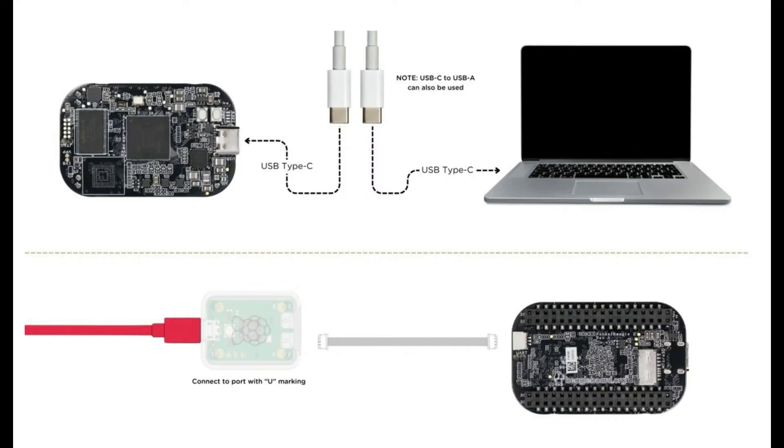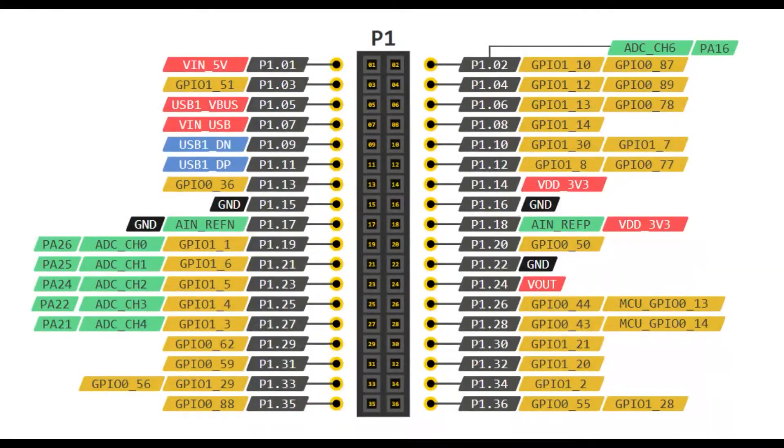There's also a little UART port that you can use with your Pico probe to connect to — there's a JST-SH connector. You plug it in and you can console in if you want that low-level control. The board is clever. These are the two headers — two 36-pin headers with a standardized pinout. They're closer together than the original BeagleBoard because it's the pocket version, but you still have a lot of stuff.